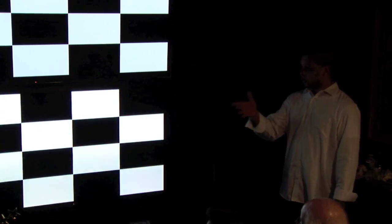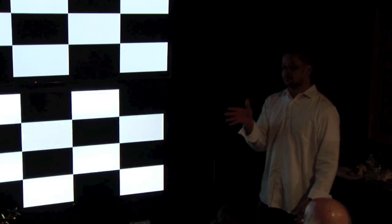One other thing you have to keep in mind with the off-screen, and I agree with Kevin, it is more real world. However, most people watch their display in different types of lighting environments. So the number that you see off-screen is only going to be specific to that one point in time if you're in a sunlit room on that given day, in that given month, in that given year. Whereas in a theater, it's more representative of exactly how your eyes see the actual image. So it is one of those controversial things. It's environment dependent. So yes, if you have a dedicated controlled environment, then it's more valid than doing it on screen.